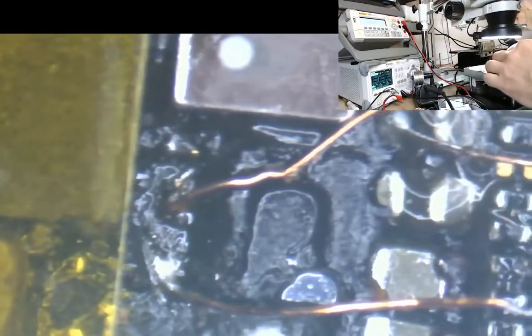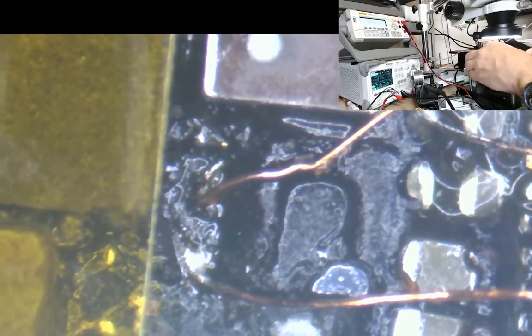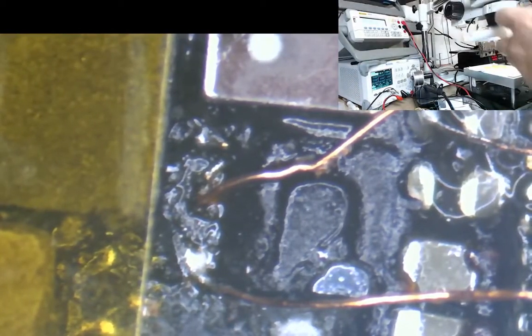I'm going to tie the board down a bit more. It's a bit damp, it's a bit wet, so I'm just going to tie it down there as well, and a bit over there. So that's the board pretty much stuck down now, so it's not going to move. I move my hot plate rather than moving the board now. So first things first, I'm going to remove this coil so I can get access. Oh, need a little bit more flux.